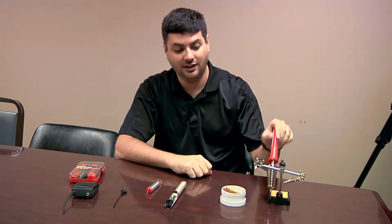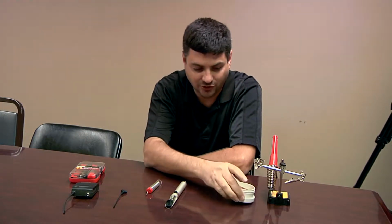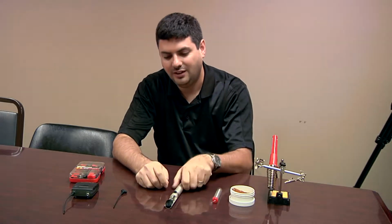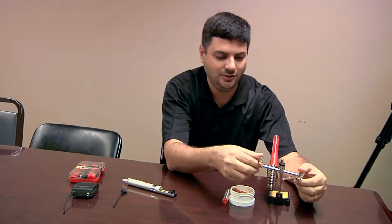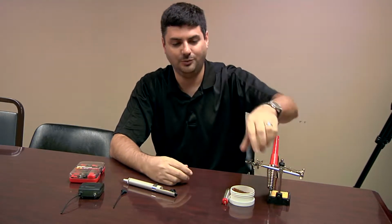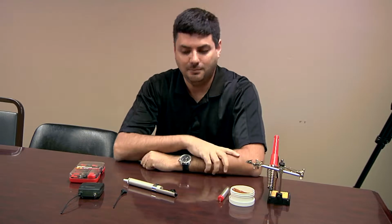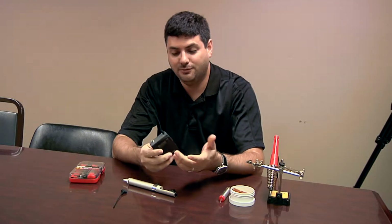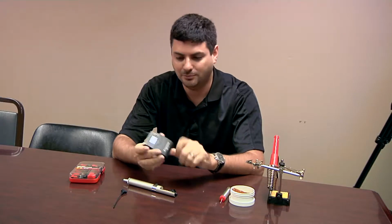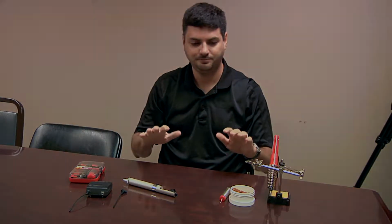And then beyond that, you're going to need a soldering iron and a holder because you don't want that on your desk. Some flux so you can clean the tip, the solder, a solder sucker, and then something that you can actually use as a third hand so you can hold the board that we're going to be pulling out of this to solder with, because you don't want somebody else holding it, and there's no way that you can do it yourself. All of these together, probably what, 60, 70 bucks? But with us, it was a good investment, even for the first one, because these are what, 500 bucks, 600 bucks? And we had 2 of these to do. So the more you do, the cheaper all of this becomes.